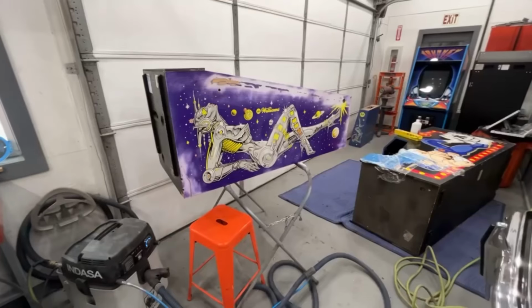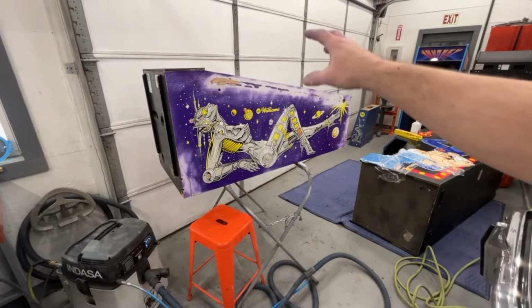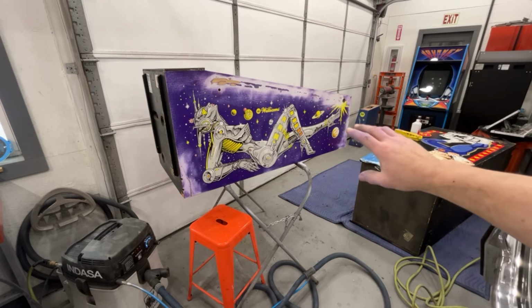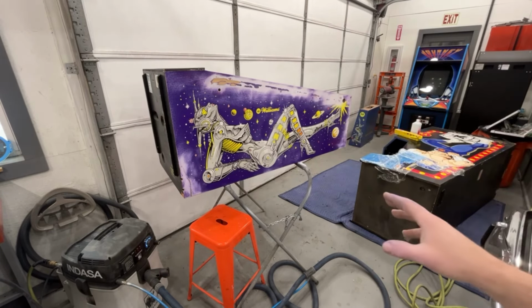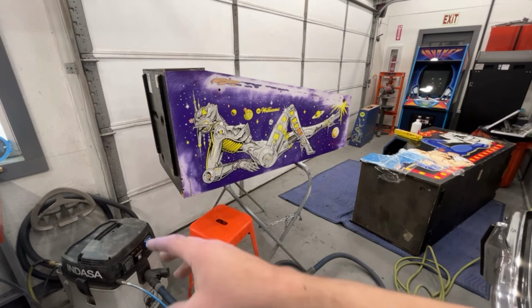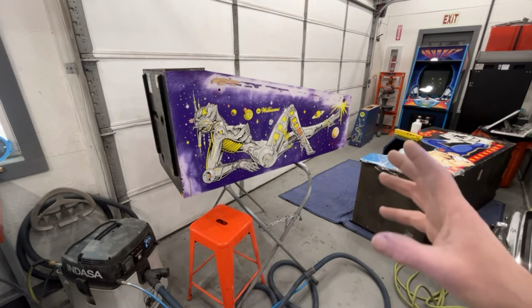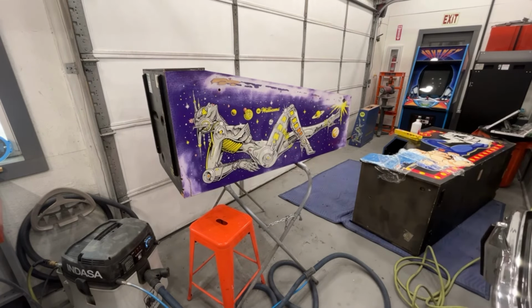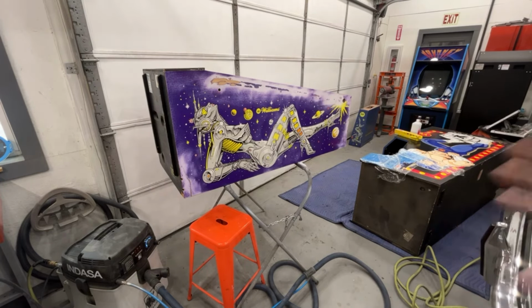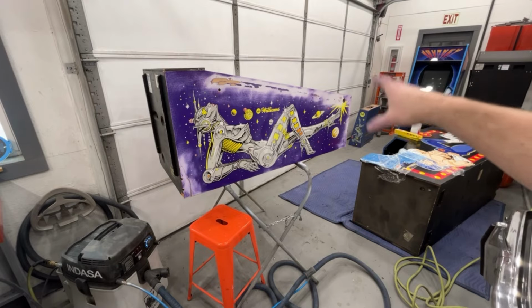Okay, I got rid of all the double-sided tape on both sides, sanded anything that was puckered up. Now I'm gonna go over the whole cabinet with 180 grit, and then at that point, blow it off, and we're gonna start doing a little bit of body filler to it. I'm not wearing a mask right now because I do have my vacuum system hooked up, and this stuff is really not very dusty, very, very minor. But this vacuum sanding setup takes about 90% of the dust out of the air. When I do the filler and stuff like that, I will wear a mask because that stuff gets in your nose and everything, and it just sucks. So, all right, I'm gonna go get these three sides sanded down with 180.